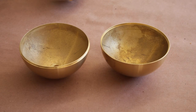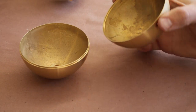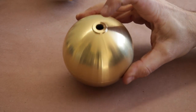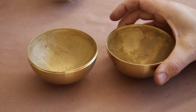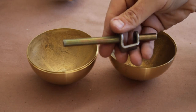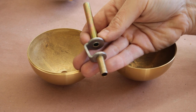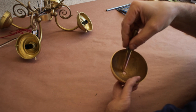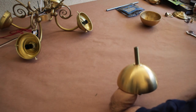I'll set that aside and get started on the ball portion of the lamp. This is where all the brains of the flickering light effect will live, so I'll have to get creative with its assembly. The first thing I'll do is grab a threaded rod with a one-inch hickey installed. The hickey allows a way to pass cords through the threaded rod from one section of the lamp to another. I'll start by adding on a finial to one end, which will allow me a way to access this section should I need to make adjustments in the future.